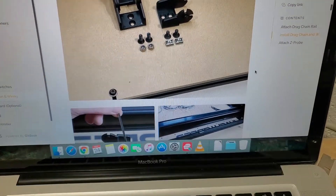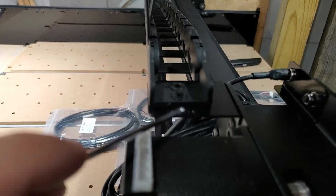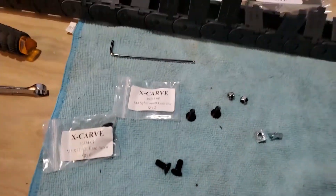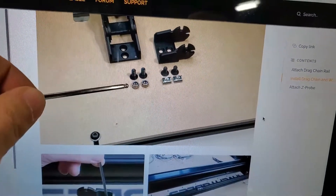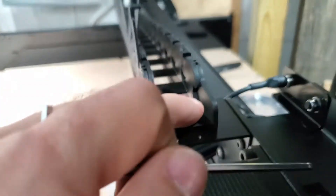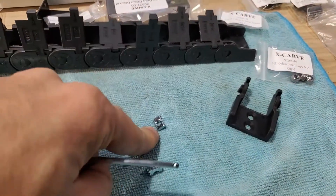Another learned moment: the top mounting bracket is held on by the nylon nuts. The instructions say to use M5 times 10 flathead screws, which is true for the t-nuts, but for the actual regular nuts you use M5 12mm flats. So I need to swap these out — these are currently the 10mm flats — for the 12mm flats, and use those 10mm flats for the other mounting bracket. For the nuts use the 12s; for the t-nuts use the 10s.